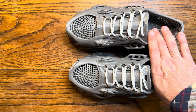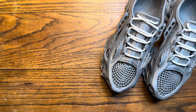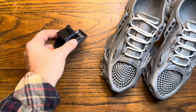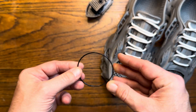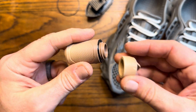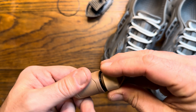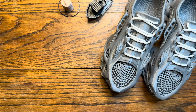TPU is what I used, and I'll show you a couple other things I printed with it during this phase. First I printed a benchy — you can flex and bend it, which is pretty cool. I also started printing gaskets, which is really what I primarily use TPU for. Like if you have a container and want a watertight seal, you can 3D print a gasket that slides into a groove and you've got a watertight pill container. Stuff like that is really great for TPU.